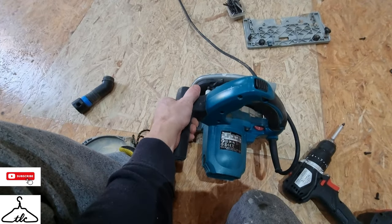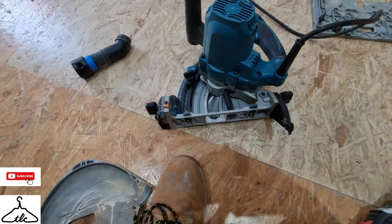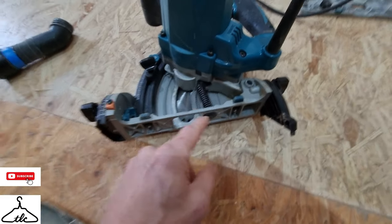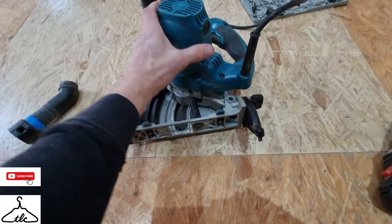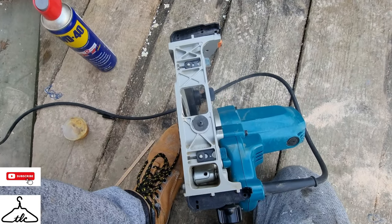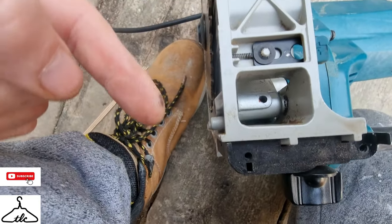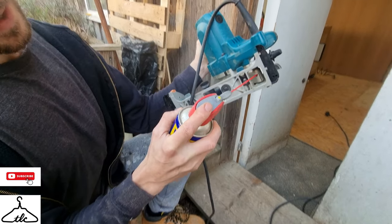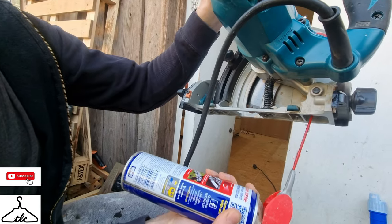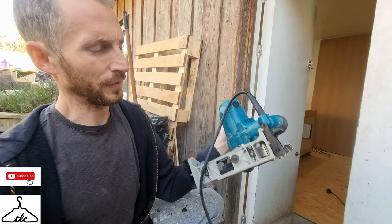As you can see it's really stiff trying to do this one-handed. Now we just need to lubricate that pin — that is the only thing it can be. The spring is only a guide to push the saw back up to its original position after cutting. With the saw turned upside down, I squirt some WD-40 into that pin to flush out all the dirt. You can see it coming out a little bit black — let that drain out for a couple of minutes.